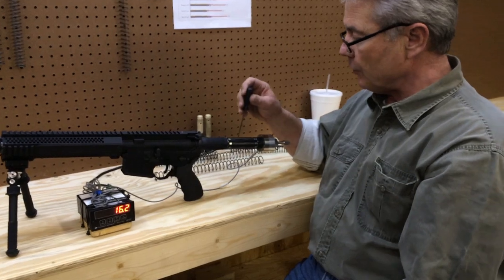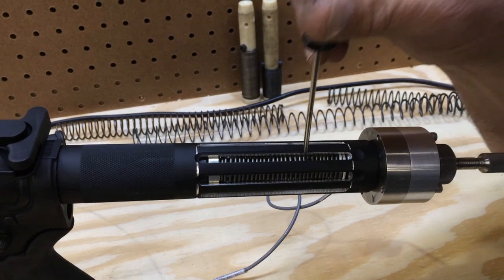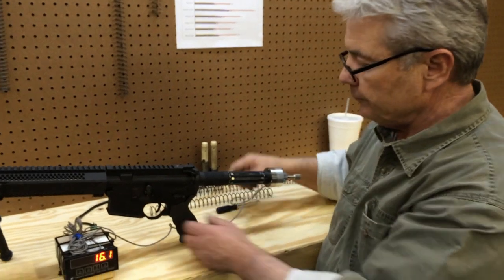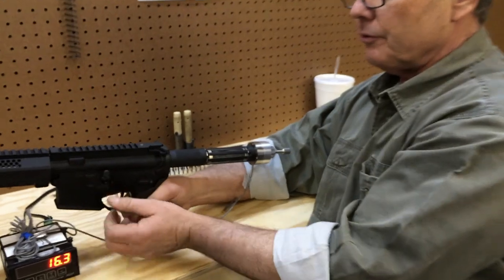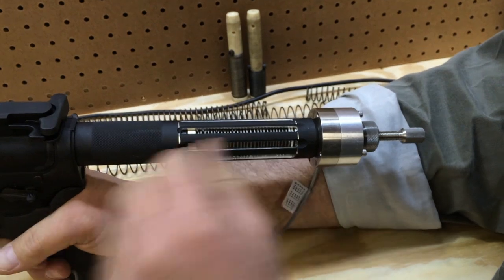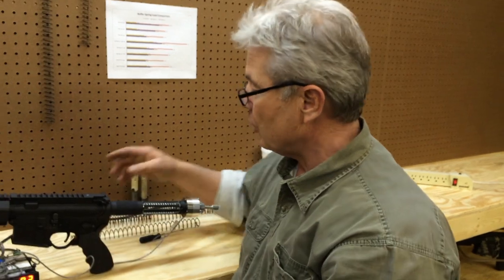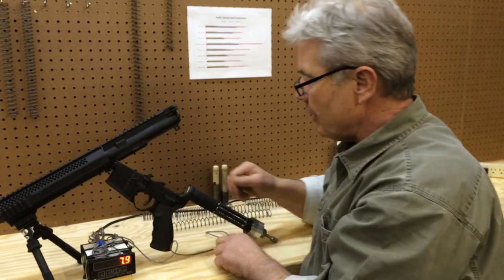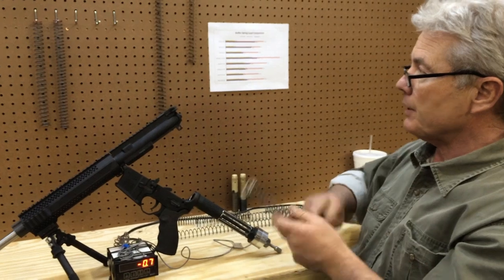The other thing to note is if you look, you can touch the gaps here when pushed — and right at the back, they're all touching. And you can watch it — it also has a little vibrational node to it. See how it rebounds itself? The flat wire spring is much smoother, much quieter, and much more — beautiful. Anyone with any engineering sense would know that a flat wire spring is actually a better design. Look at a Glock for example.